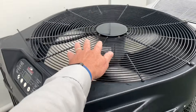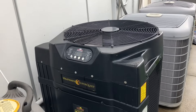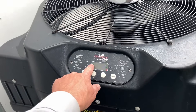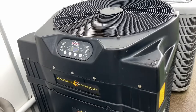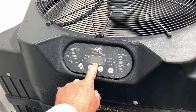The customer's complaint is that it's not heating the pool. When I got here, the red light was on for heating and the green light was on for pool, but the water temp hasn't changed and the compressor was not running. I'm waiting to see if we're going to get an error message on the display module.